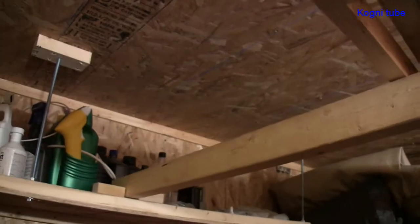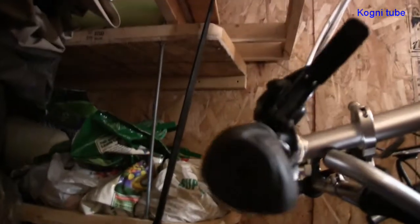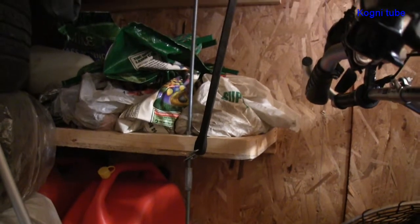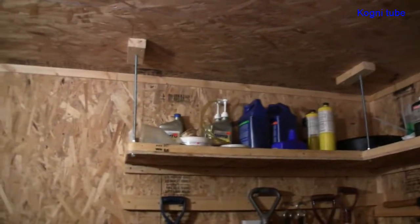Here, because 7/16 of an inch wood is used, it can be screwed directly to the wood. If it's thinner you need to use the truss of the side of your garden shack. Another thing you can see here is that the end shelves are not all the same length — you're not forced to put the rod at the end of the shelf. You can use your imagination and put it at different places to suit your needs. Here you see an adapter that allows you to increase the length of the rod.